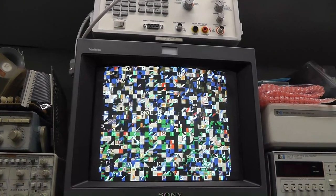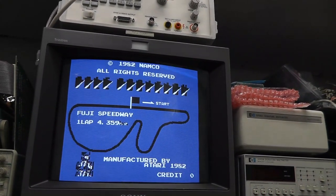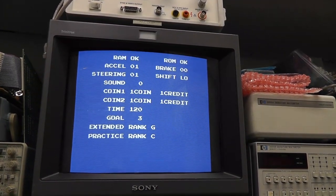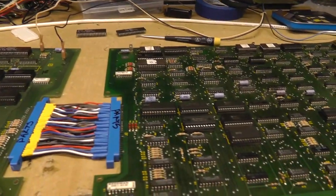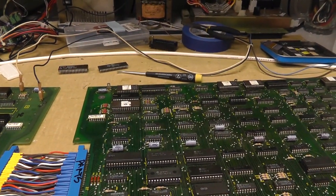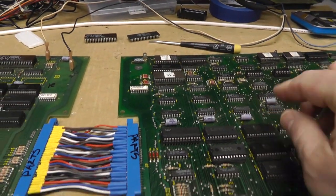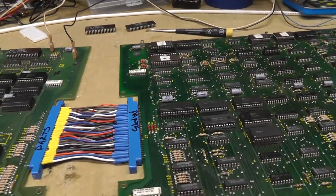Let's power on. I get RAM 31 and then an OK message, boots up fine. When I hit the test I'm periodically getting RAM 31 which is 4E, and RAM 49 which is 4F. I'm not sure if it's the socket or what, but we'll come back to that.